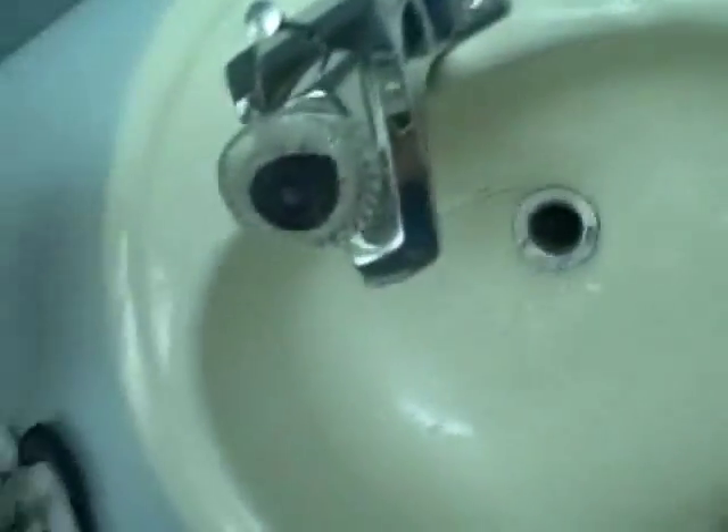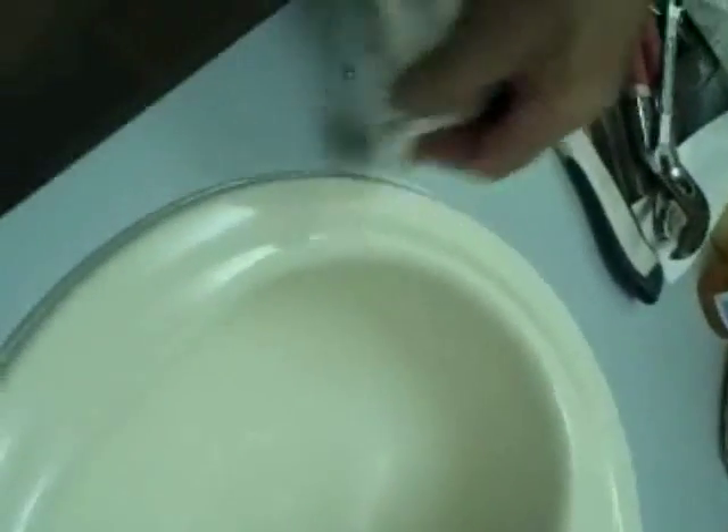Now since we're on this side, again the wet finger. We just put the finger down with pressure and bring it around on the caulk. What this is doing is forcing that caulk underneath the lip of the sink. Now you'll notice here I have excess on my finger — we'll get that off — and then just come back with the finger again and just kind of clean up a little bit around that edge. Then we'll take the rag and drag up the excess. If you go over on this side and take a look, you'll see that it's a nice thin line of caulk that goes around there.